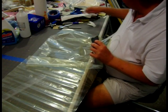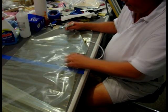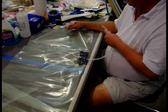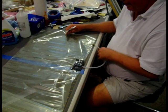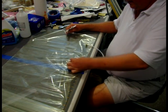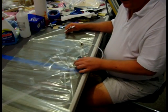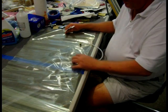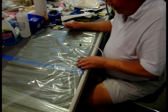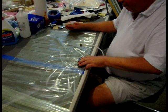And that's all there is to making a bag with tacky seal for vacuum bagging your wings or other parts. We've got the tube sticking out so that we can get the breather to it, and the tubing with the fitting. The thing to do now is to pressure test or vacuum test the bag. What you do is hook it up to your vacuum rig and check to make sure it pulls the amount of vacuum that you expect. I'll hook this up to my vacuum pump just with a piece of breather in, and if it pulls up to the vacuum level I expect, I'll know I don't have any leaks in the bag or around the vacuum line.